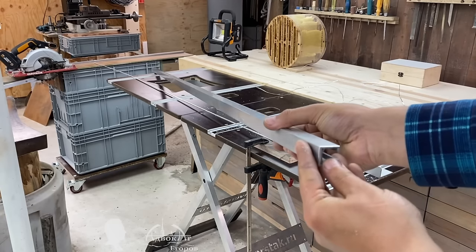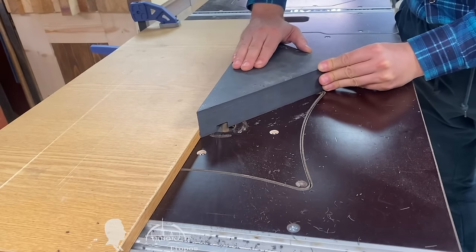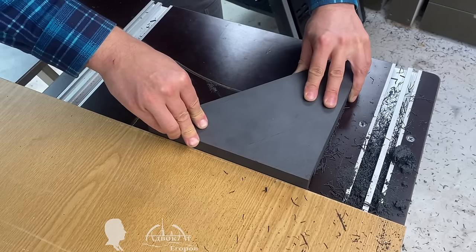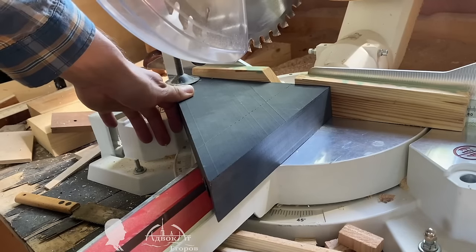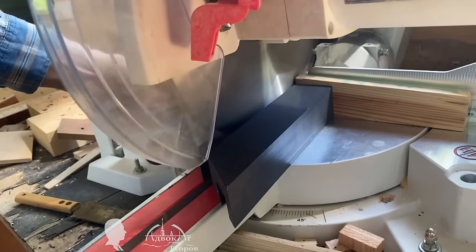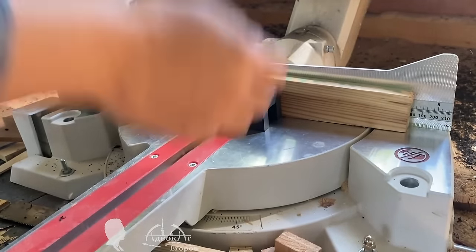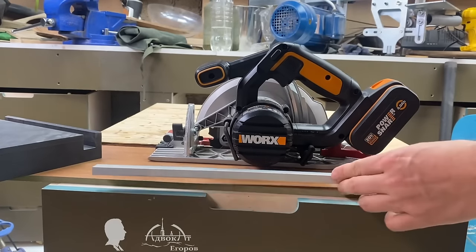The leftover aluminum strip can then be melted down into some useful product. The guide is ready. It remains to marry it with a regular circular saw by simply adding two blocks with slots for a 20 mm profile to its base. I made the blocks from scraps of graphite-filled caprolon polymer, but you can make them from other polymers such as PTFE, nylon, or even oily wood. First, I milled a 20 by 21 mm slot, and then I cut the blank into rectangular blocks. I have a great jet miter saw and I'm quite happy with it, but I want something lighter, more versatile, and compact. You might decide to make such a miter device based on a circular saw you already own, but I wanted to explain the criteria I used when choosing a circular saw for the People's Miter Saw project and related accessories such as guide rails and angle stops.